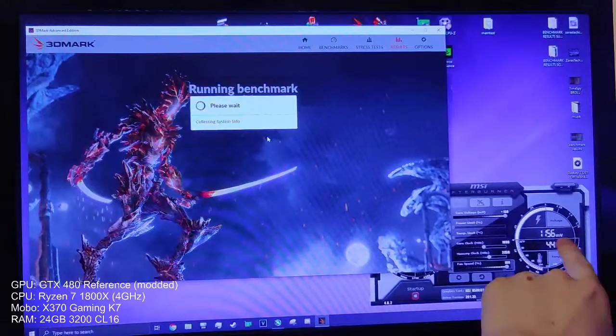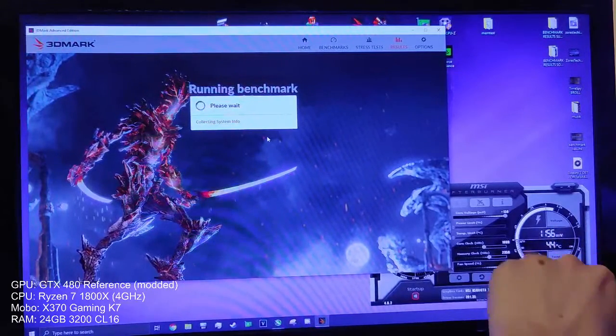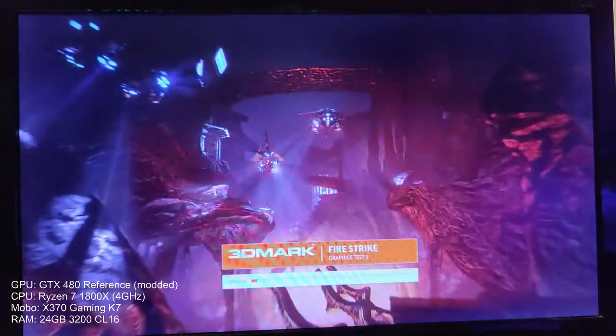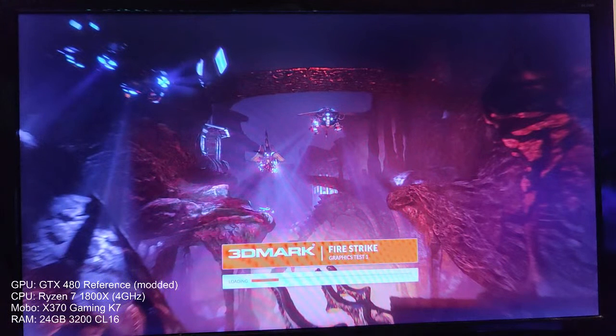And yeah, you see again here it reports the voltage that's slightly too high. It's 1.13 volts behind the core, and on die it's probably even lower, like 1.12 or just straight up 1.1. I don't know how the voltage drop is over the BGA and into the substrate. So yeah.